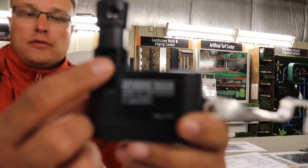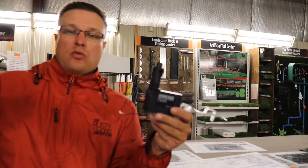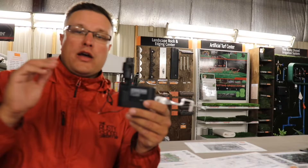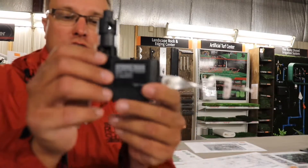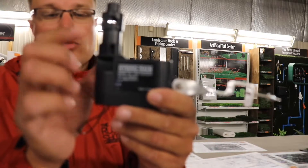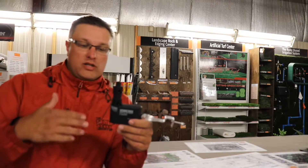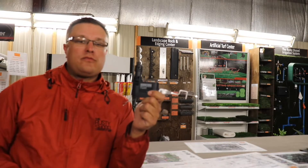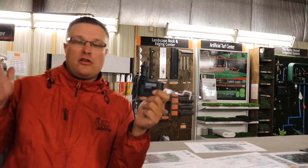The other thing is this vent. A lot of times people will say 'my rain sensor isn't working.' Sometimes when it rains with a lot of wind, this vent will actually dry out the cork as fast as the rain is coming down. Just play with it a little bit — wide open isn't a good idea, but keeping it slightly open allows wind in to dry the cork, just not too fast. That is the rain sensor from HydraRain that you can add to your sprinkler system so you aren't watering on a day like today.